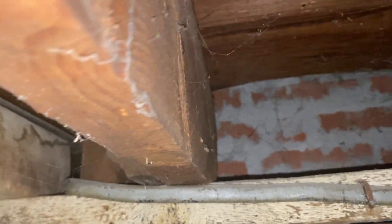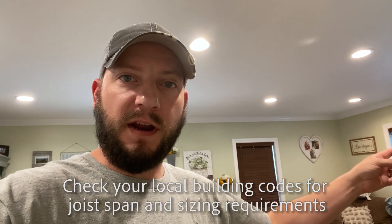As you saw in my basement, the joists, when they land on a wall or a beam, are typically broken — which means they're cut and they kind of overlap each other and are connected. Now in my living room, these joists were actually run all the way 20 feet and they were 2x6. Not only were they 2x6, but they were also 24 inches apart. You'll hear the term 16 inches on center — that means from the center of one joist to the next joist is 16 inches apart, and that is standard nowadays with wall studs and joists. So that's another thing you need to take into account: just because they're run all the way and they're not broken doesn't mean they don't need a wall underneath them, because 2x6 is way too small to have a span of 20 feet from one outside wall to the other. So that wall was load-bearing.